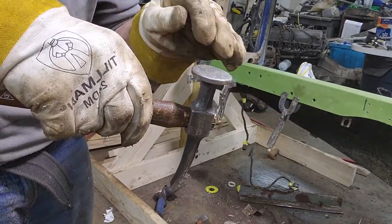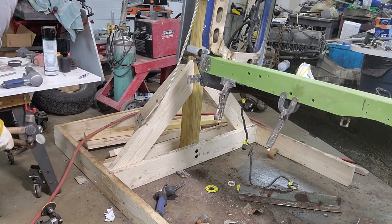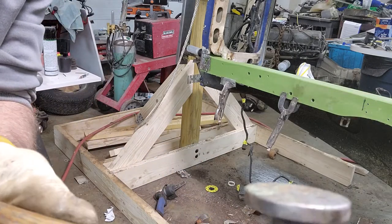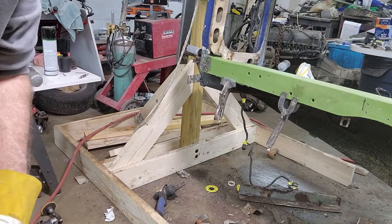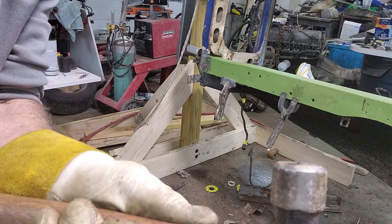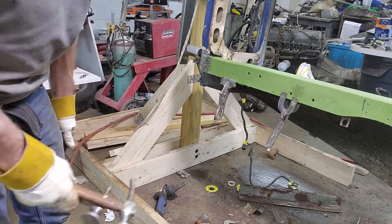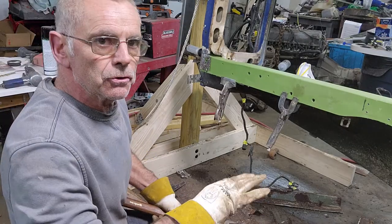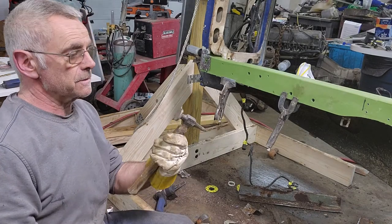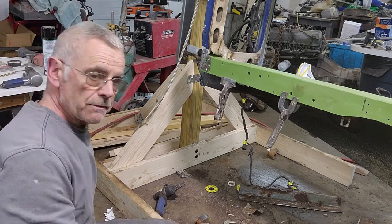All the other hammers are rounded. So when you're trying to hammer stuff out, it actually makes dents in it. So both my, here we go, here's the hammer that shows it. Both of my Snap-on hammers have flat heads on them. I won't get too close. So see how flat that is? It seems like the aftermarket or the cheaper hammers have rounded heads, like the ball peen hammer, and some of them are even rounder than that. And when you're trying to work the metal, it actually makes dents. I mean, in some places, if you're doing curves for where dents are, then that's fine. But mostly, the Snap-on ones, I think, are the best. They have a great feel, and the heads of them are flat.